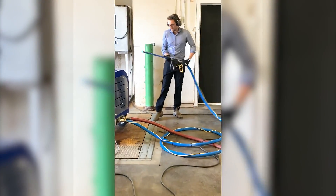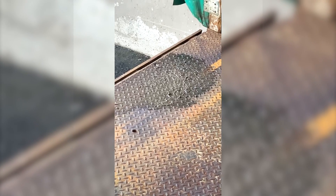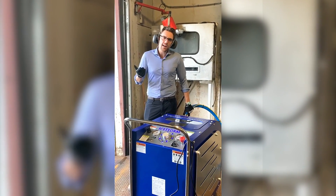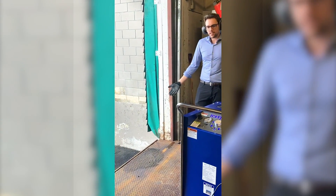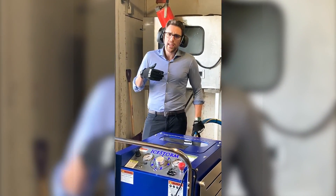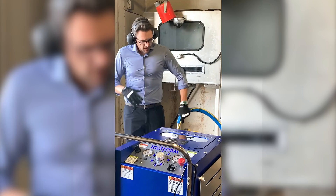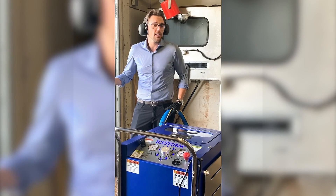Come over this way and you can see here — this is oil and grease, and looks like some other really nasty stuff. One of the things we can do is if there are specific parts you want blasted, you can send them to us. We can blast it for you, do a demo video just like this, or you can rent machines. We can do a variety of ways. With a lot of plants and facilities, we actually time cycle times of cleaning for automated systems. We can actually put this on a robot — we partner with KUKA — so we can offer that type of automation and customization for any type of system you want.